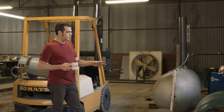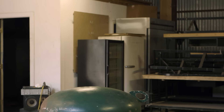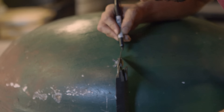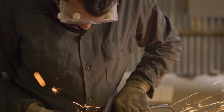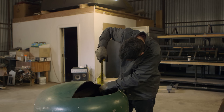Now that we've got the smokestack on, it's time to work on the firebox — it's a 250-gallon tank cut in half. What I'm about to do is take a straight edge and mark a line all the way around; that marks where the 24-inch pipe is going to go on the inside, leaving a 3-inch air gap so it's semi-insulated. In the process I'll also mark the hole for the exchange between the firebox and the cook chamber. I measure straight down to the floor from this opening to determine how long the liner is going to be: 37 and a quarter inches.